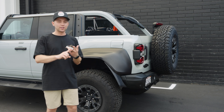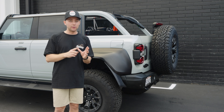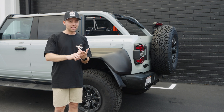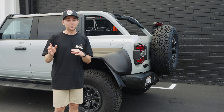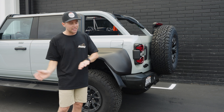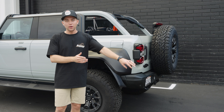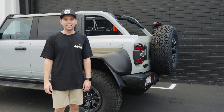You have 3D scanning, reverse engineering, CAD design, CNC machining, prepping the plug for tooling, making the tooling, then prepping the tooling for production, and last but not least part validation — so installing it on the vehicle to sign off on everything and finally to make those orders. So we're gonna start this series, it'll be called How It's Made by ADV, and let's get started.